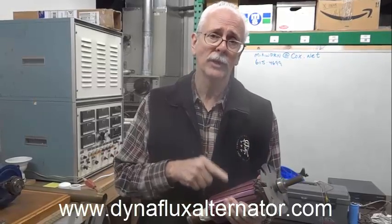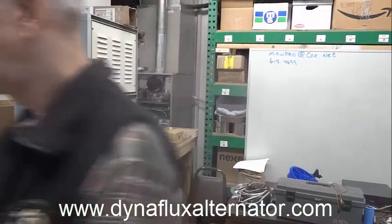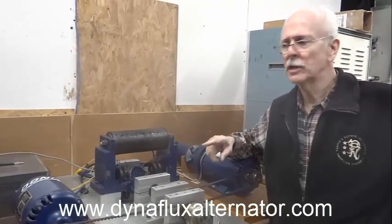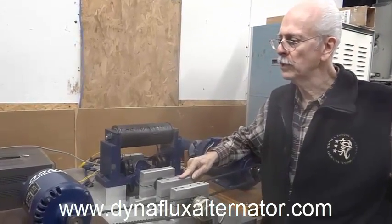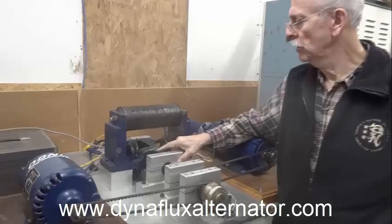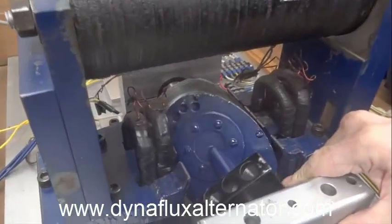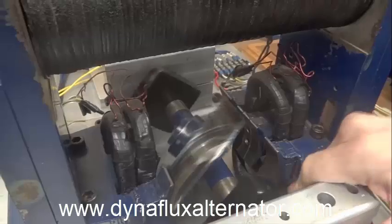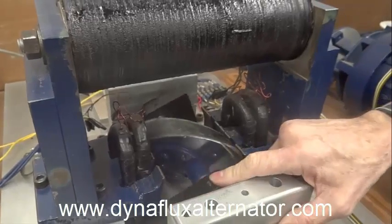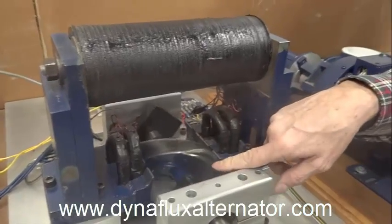But that's only true of this particular geometry. Now I'll demonstrate a different approach. You noticed in the previous piece of equipment that I showed you, the shape was cylindrical. If you focus on this machine, you'll see that we're making use of a very unusual geometry in the rotor. It's actually an ellipse — an ellipse in 3D. But the cross section of that ellipse is still circular or cylindrical, and so it can rotate between two field poles without any difficulty.